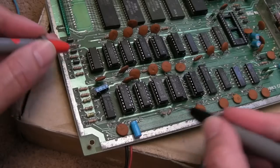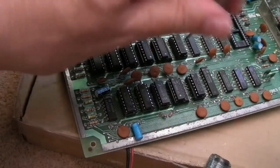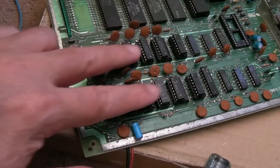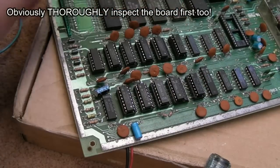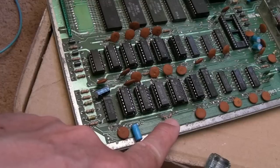That's just hard to believe. So this side, is this 5 volts then? Yeah, 5 volts is a pull-up. There we go. You learn something, I learned something. When you look at a RAM fault, obviously check these. If you see a low on the AEC, you need to be looking at this. Check that resistor. Just make sure someone's not shattered it in two like that.